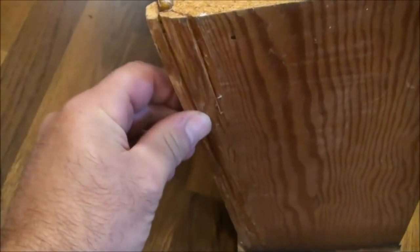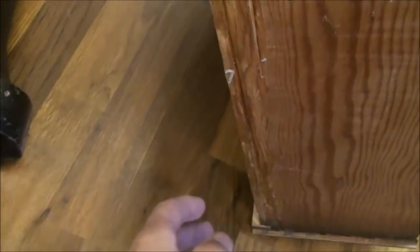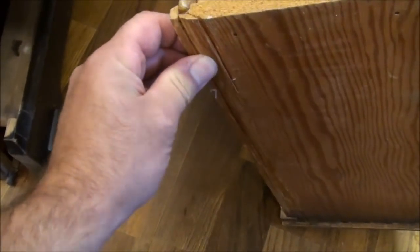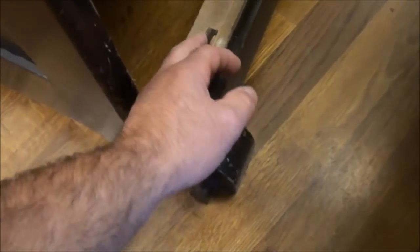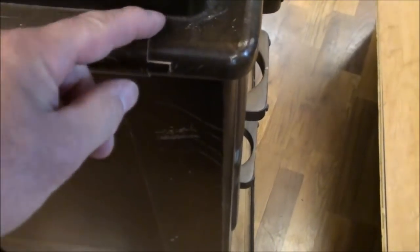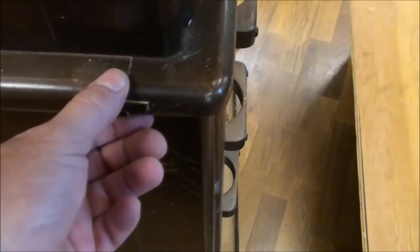This one here has been worn, so I'll have to figure out what's causing this problem. This part here is actually broken off up to a certain length, so I've got to do some repair on another part of the drawer. This little tab here needs to be bent forward a little bit, readjusted to match the other ones. There's another spot here where this has come unglued, so I'm going to have to somehow glue this back and fasten this back together again, and blend that in.